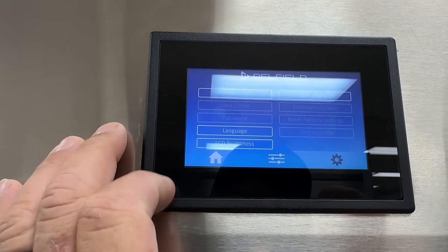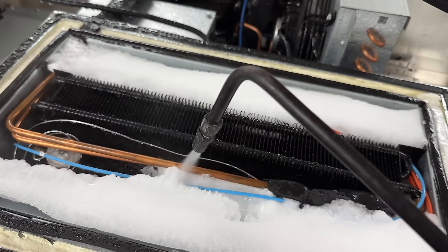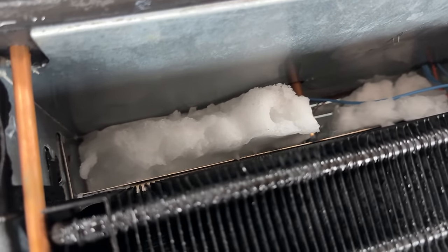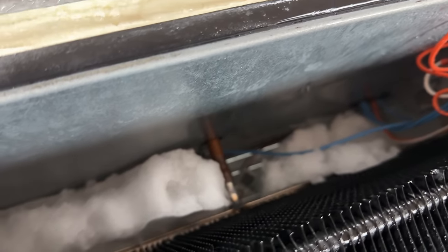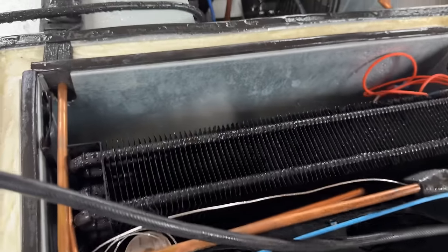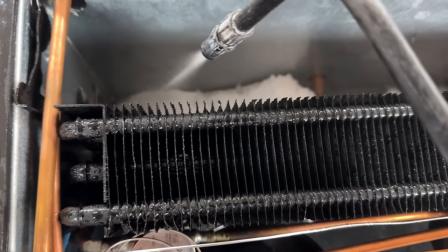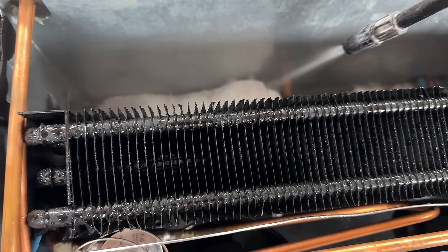We just put it into defrost — let's go back out. We're going to need to find that stuff out. We just about got it melted except for all this back here. I'm really glad they didn't turn it off — I would definitely let it keep running. It definitely added a couple extra minutes to the time clock. Supposedly this is all under warranty. I have to get a manual from Delfield, which is pretty awesome — it's like 107 pages. I've got passwords and you can change the defrost to time instead of accumulative, which half the problems usually are with accumulative.